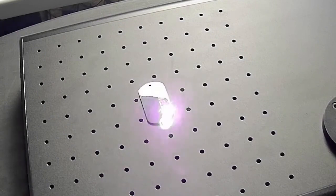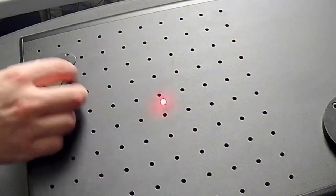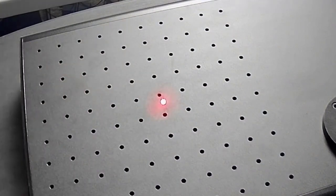Mitchell Huntington got an order for 140 shot glasses today. Congratulations, Mitchell. That's awesome. Is it easier for blacks with JPT frequency range? On steel, I would argue no. Z-marking is not a high-frequency mark. I know some people that use MOPA lasers to great effect for getting faster black marks, but non-MOPA JPT is probably just overkill. You're probably just adding extra money for no particular reason.